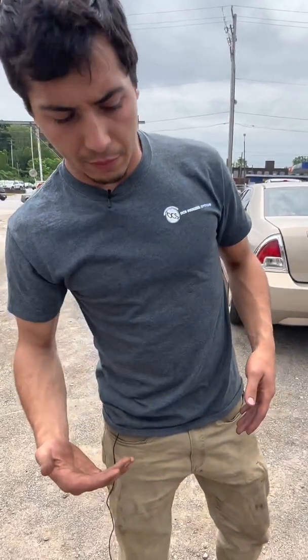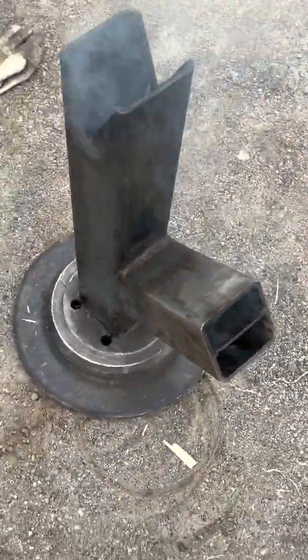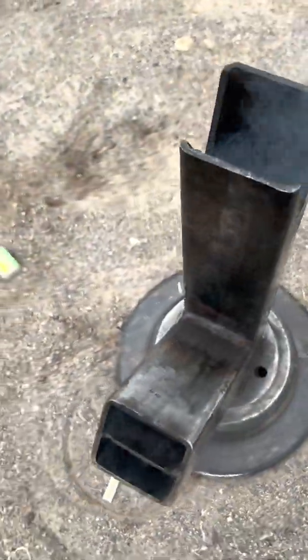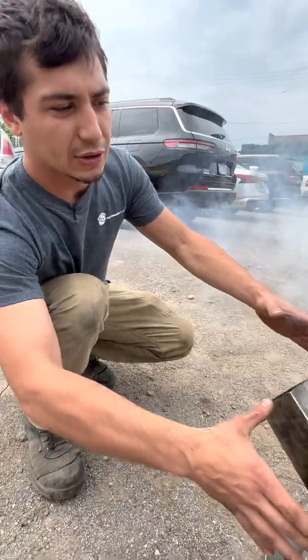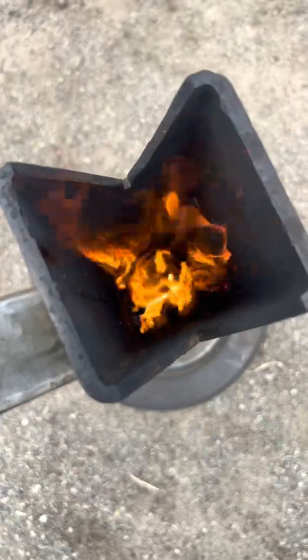What they did, they used TIG and MIG. What it has is that air hole through the bottom of it — it allows air to get through underneath. We just took 4x4 square tubing, we took an offset 45-degree feed tube, and that's where you'll feed the wood through. The air comes up from underneath, so you're getting a jet of air, kind of, so it burns a lot cleaner, a lot more efficient. It'll shoot it up the stack so that you get a nice hot burn.